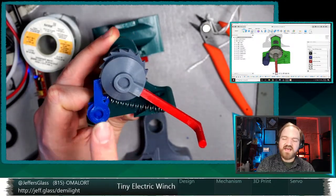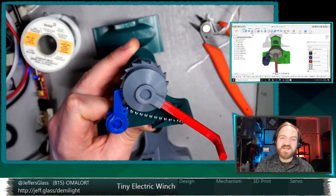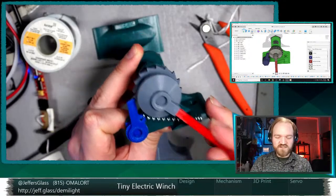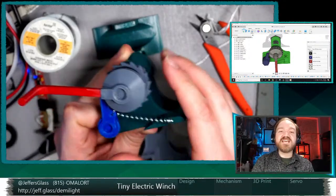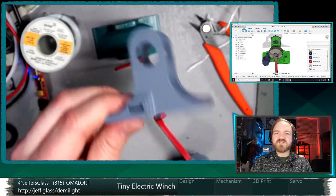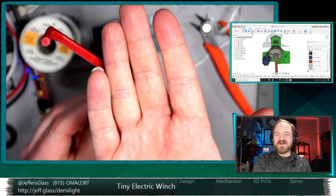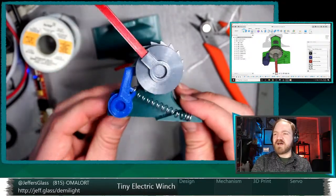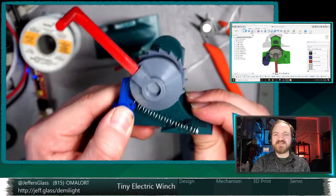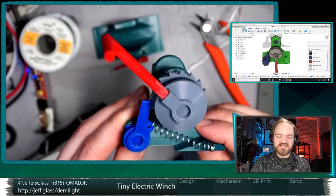So in this case, I either needed a left side ratchet and a right-handed thread, a standard thread, or I could mirror the entire design: a right-handed ratchet and a left-handed, reverse thread, if I really wanted to, but I didn't want to. So here we are. But you'll see as we get into the drafting later today, I didn't realize that until after I had done the bulk of the design. So one of the last steps in the Fusion 360 file was to take most of the parts and mirror them 180 degrees. At some point, if it looks like the model is backward from what reality is, it probably is. I'm trying to keep that basically the very last step on the timeline. So I'm drafting in reverse and then mirroring it at the end, because that seems to be the cleanest way to do it at this point.